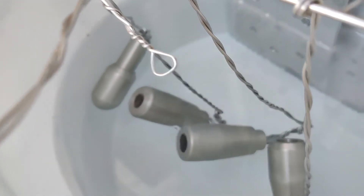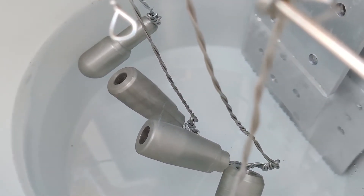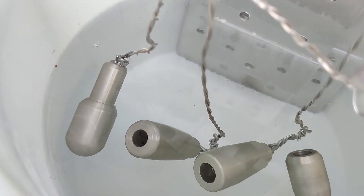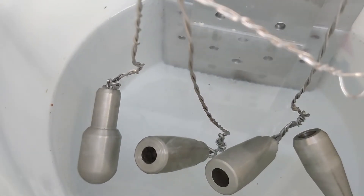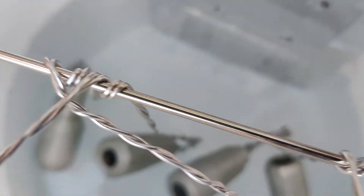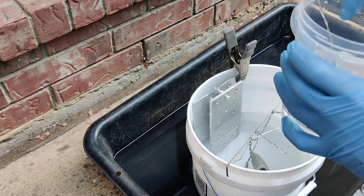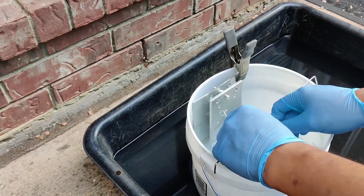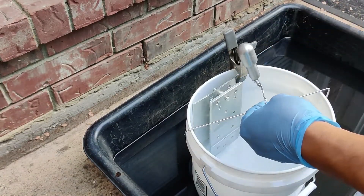After a while you'll notice that the bright shiny parts put into the anodizing solution are now a matte gray color with a little bit of a yellow tinge — this is pretty normal and means the anodizing process is working properly. Once the calculated time has elapsed, I pull the parts out of the anodizing solution and put them in a mixture of baking soda and distilled water to neutralize the acid. After they're neutralized, I keep rinsing them with distilled water before dyeing.